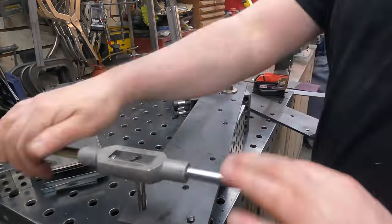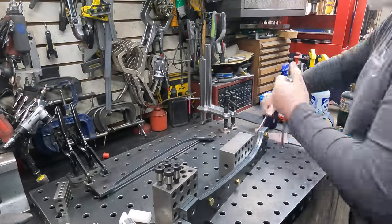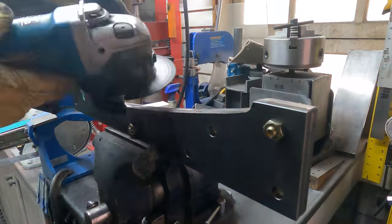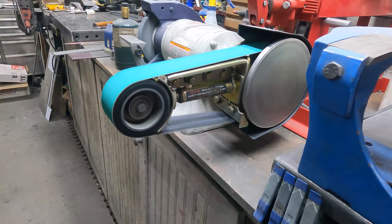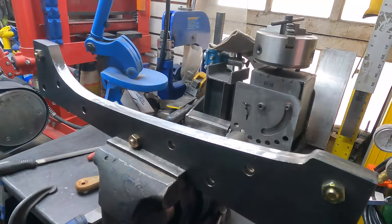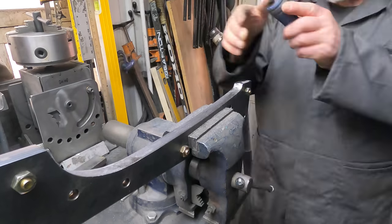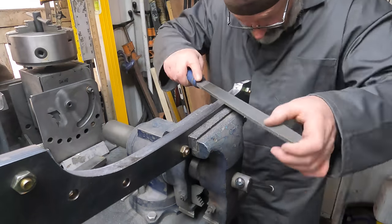We get going by threading the holes — the other holes were cut oversize and I had these holes specced to be about the right size to run a tap straight into them, which worked fine. Then I clamped both halves together because the two stainless steel halves have to join together relatively precisely. I didn't think just removing the flash would be good enough, so I bolted the two parts together, ground and sanded them — grinder first to level everything out, since there is a wander to the kerf on any plasma cut — then over to the belt sander. I got the file out and made sure it was actually square and flat and fitted that wooden part as perfectly as I could. At the end of that I was confident those two parts were accurately fitted.